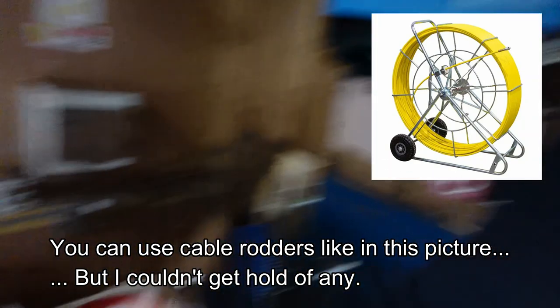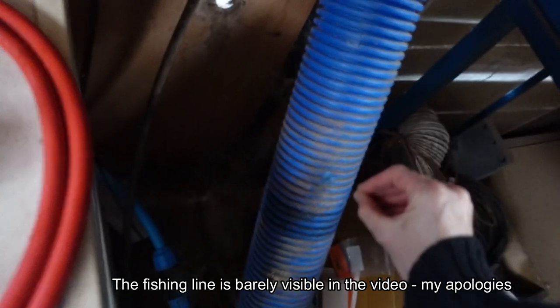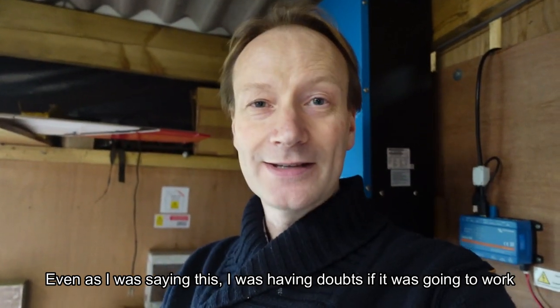What I've done is drilled a hole at an angle all the way through. I'm going to put a thin nylon fishing line through the hole, then attach a polythene bag to it and stuff it down the pipe. Then I'll use my leaf blower to blow the plastic bag all the way through the ducting. Hopefully it comes out inside the house, and then I can attach baler twine to it and pull it back through as a proper pull line.